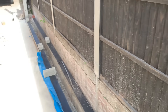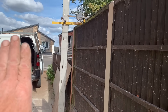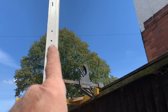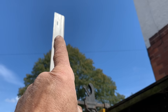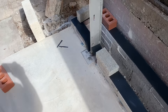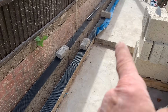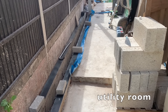As you can see there, I've used the same principle, and then the other fixing there fixes through to the wall plate because we've got a parapet wall going into the parapet. And then we've got this coming down here again, bolted and resined in — I've had to chop out to bring it down because that's the issue: we've got a garage base here and then we go up into the main house.